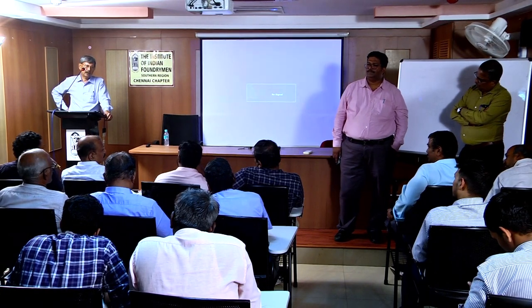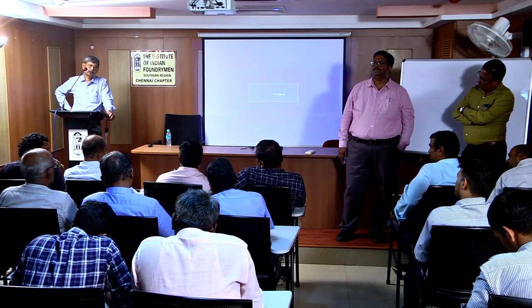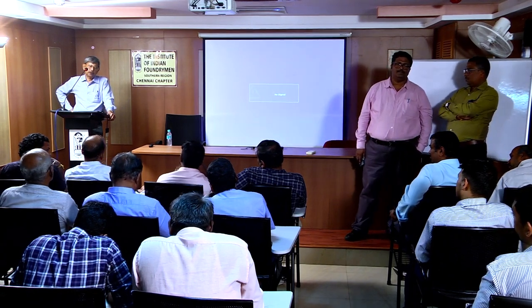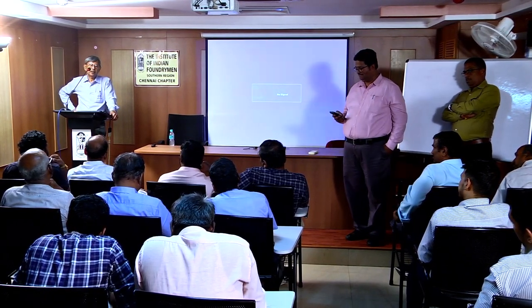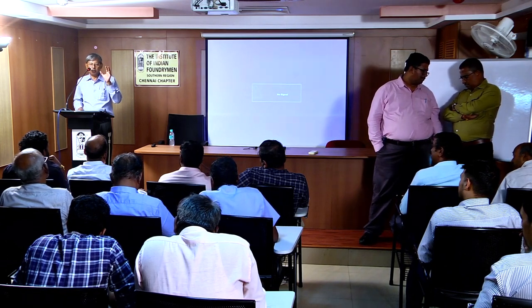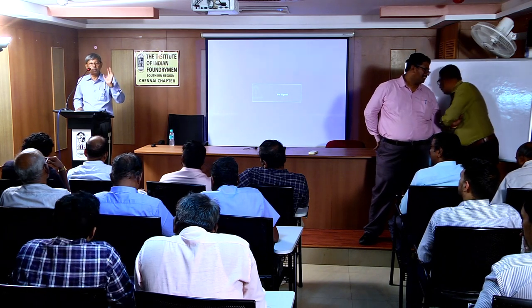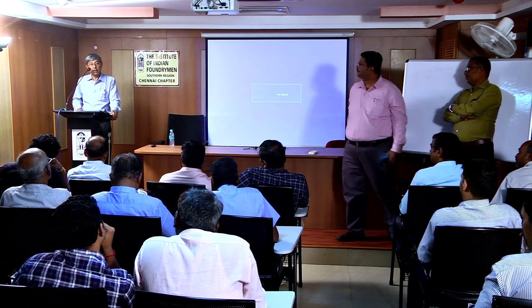We are producing cores, the same process we followed, same operations. But in the end process, when we make castings, some parts have fused cores and more, but some parts don't have this. It fully fills our requirement. See, the basic reason may be poor compaction of the sand at that area. See, if it's the corners, compaction is a must. And I told you, no, fluidity or viscosity plays a major part. If compaction is poor, then a lot of problems will come, particularly this fusion. Yes, sir. Porous cores, that will happen.